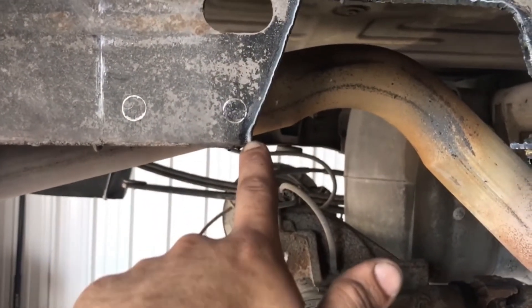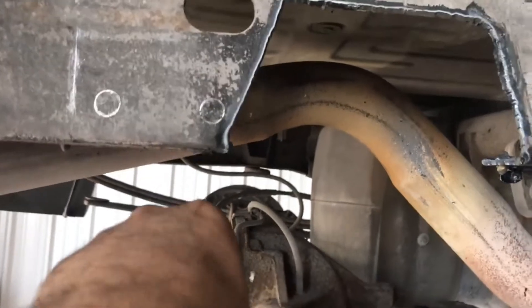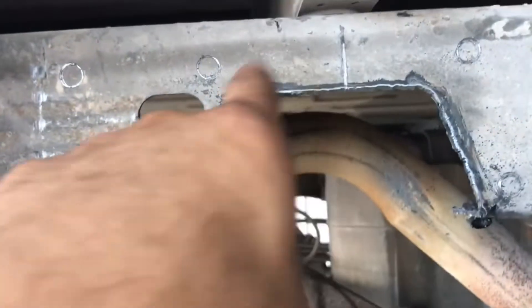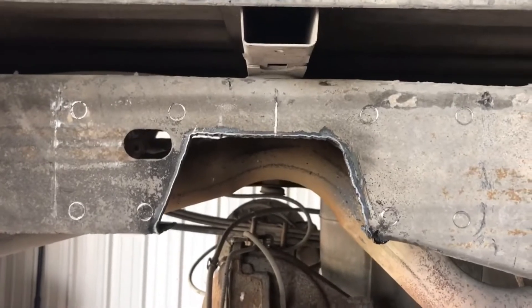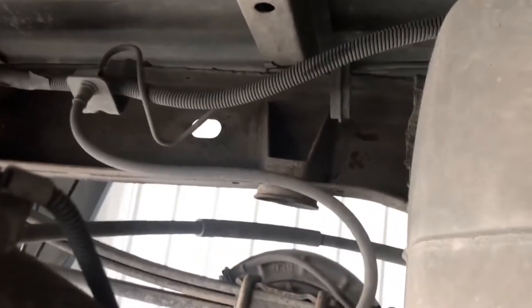I use the plasma so you've got to be pretty good at cutting it straight. I used to always have a tendency of cutting it out, and by the time you see it and put the C-notch on, it has a big gap between the frame and the part of the C-notch. Try to get as straight as possible, as steady hands as possible. I did everything with plasma and it should come out in one piece. I make this hole because of the inside of the C-notch - you need to cut that out too.